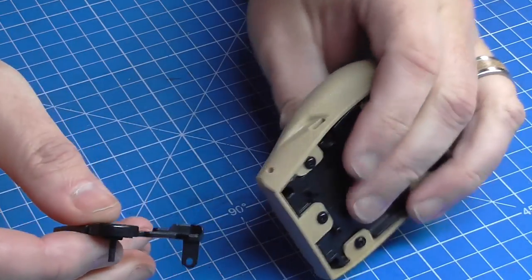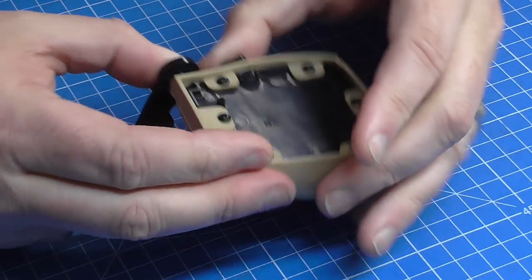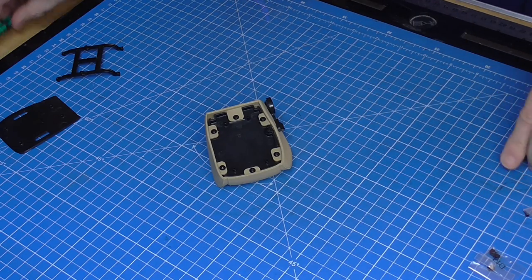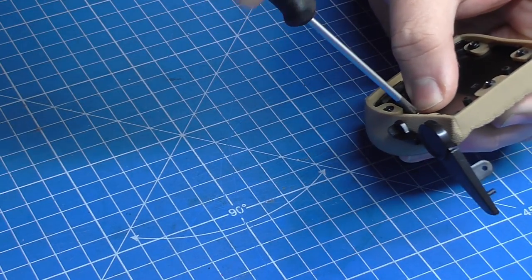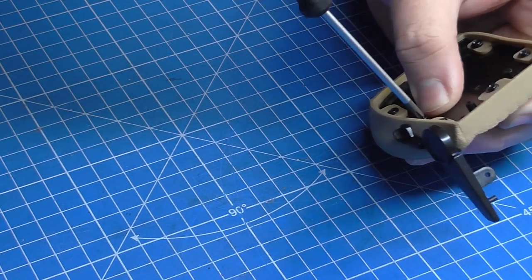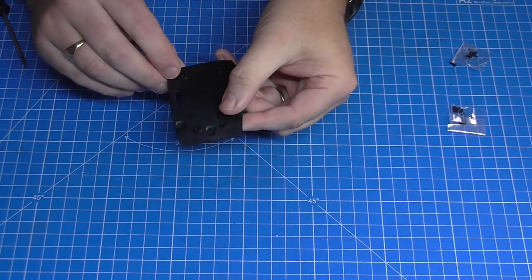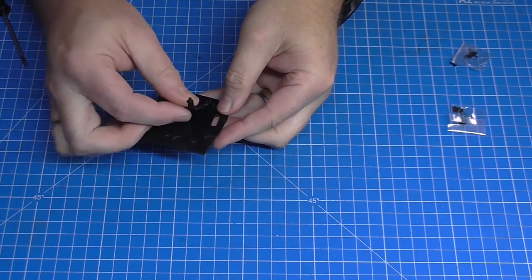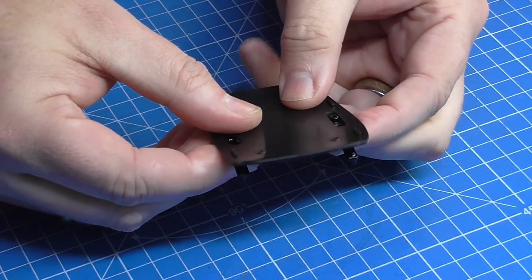We've got a tab and a slot — that's going to go into this side of the chair which has the same tab and slot. Push that through, then put this in place by putting a BP screw down there — I've got that all waiting to go — get that nice and tight in there, and that will hold that side into place. Now we're going to be taking the base and the little brace at the bottom. When this goes in, it's going to be able to move backwards and forwards, like you saw on the previous one.